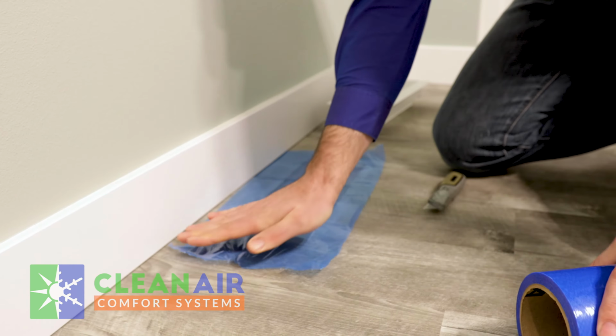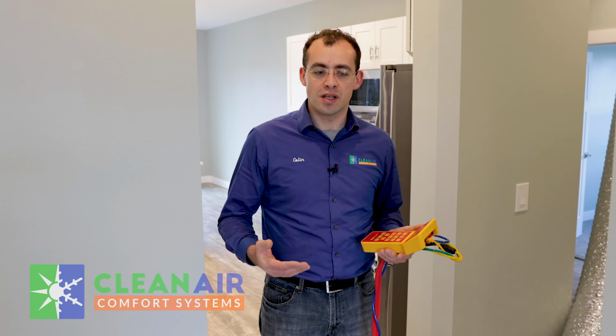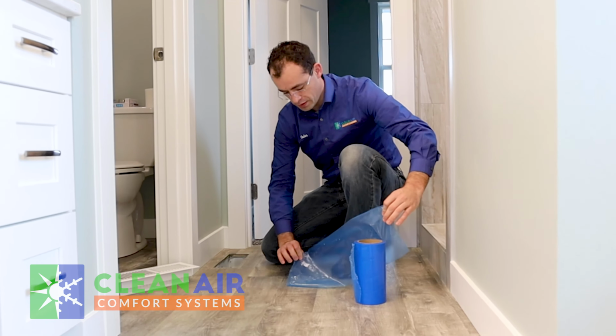All right. So when you have us come out to do a duct leakage test in your home, the whole process will take approximately 1 hour. And what we will be doing is discussing some of the challenges that you're experiencing. Then we have to have all of the registers exposed so we can seal them off. We are going to hook up the tester to your return, and the test will just take a few minutes. After we do the test, we are going to give you the results, and we'll spend a few minutes discussing the possible solutions. And at that point, you'll have the information in your hands to decide which steps you should take to improve the air quality in your home and the energy efficiency of your home.